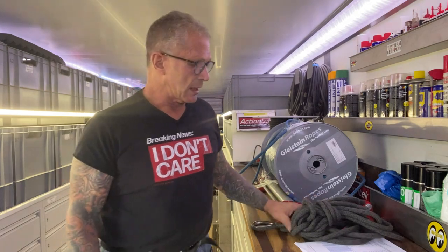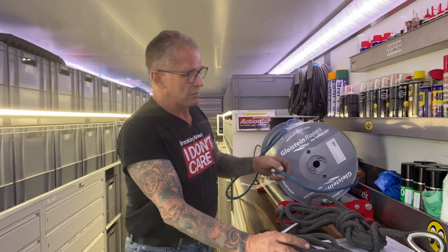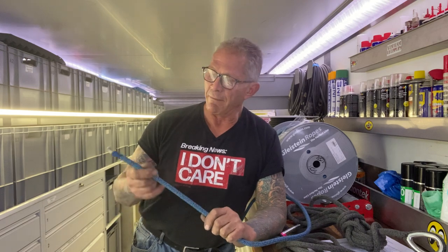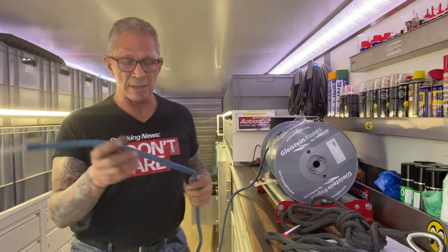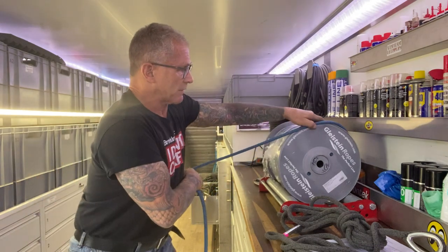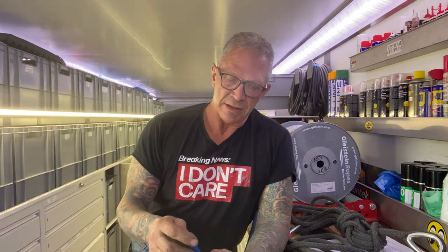As such, I started going through more of a rope design for abrasion and a rope design for the devices we use. Currently I'm using a — it amounts to zero stretch — double braid that has a Technora jacket and a Dyneema SK99 core. This is, in 12 mil, a nine ton rope. Again, you have the issue of the core and the jacket being separate. The strength of the rope is not jacket dependent — it's just there for protection. So you end up having to milk it in one direction if you use it a lot, or else you end up with a really ugly, messy end on it. It's fairly heat resistant, even though it is Dyneema in the core, because you have this heavy jacket.